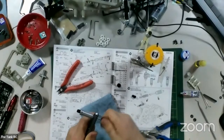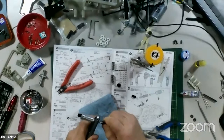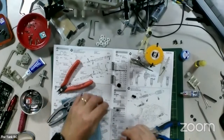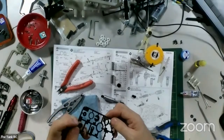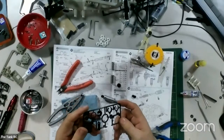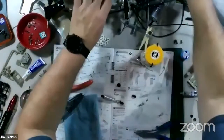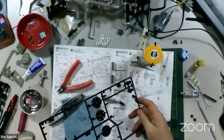If you can't find a polishing stick for a commutator, you could always get, you know, those erasers that were the white and the red. You use the white side on it and it'll clean them. Shaped like a parallelogram. I heard that. Yeah, that's up from a pencil, yes. Right? No, the long rectangular looking ones. They're angled on the ends, like a parallelogram. Yeah, yep. One's red and one's white. Yeah, I've seen that before. Yeah. You can pull the brushes out, pull the end bell off. Yeah, okay, I see. Like two coarsenesses of the eraser, the two different colors. Is the white side more coarse? Yeah, the white side's got a little abrasive to it. The red side is just a plain eraser. Okay.